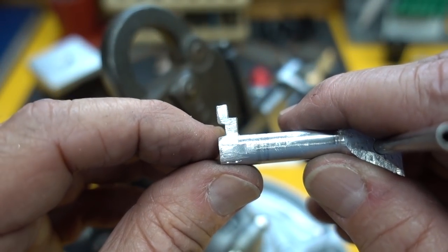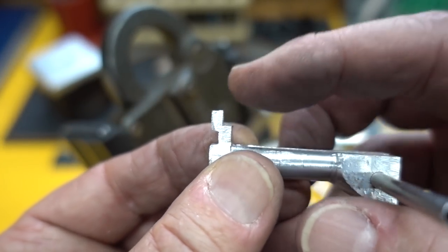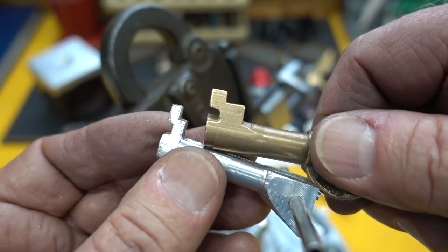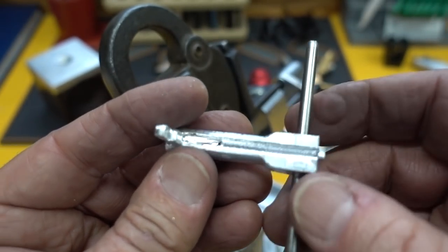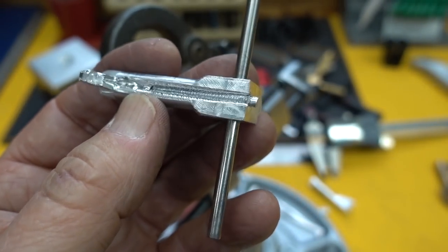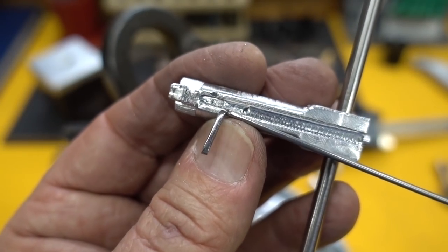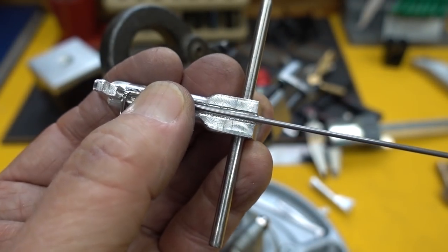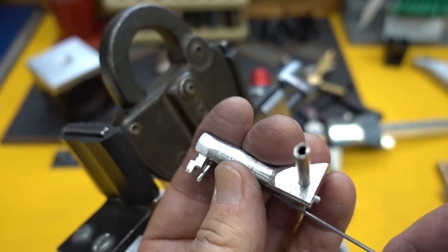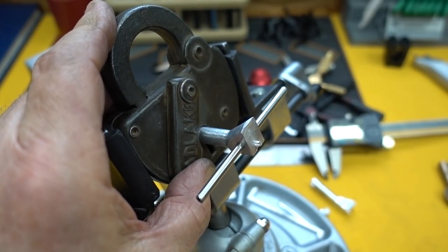I counter-milled it here to get around that anti-picking disc they put in the back of there, and then I cut off the back of it — so I'm only going after the tensioning disc right there; everything else is removed. Here's what one of the other keys looks like — I'm just going after that very tip. Because I left the diameter really wide, I had to cut a groove here. It's starting to break through in that counterbore and I couldn't go any deeper, so I have to use a medium wire — that's the only one that will fit. A wide wire does not fit, so I'm hoping this wire doesn't break. I did check it — it does fit.